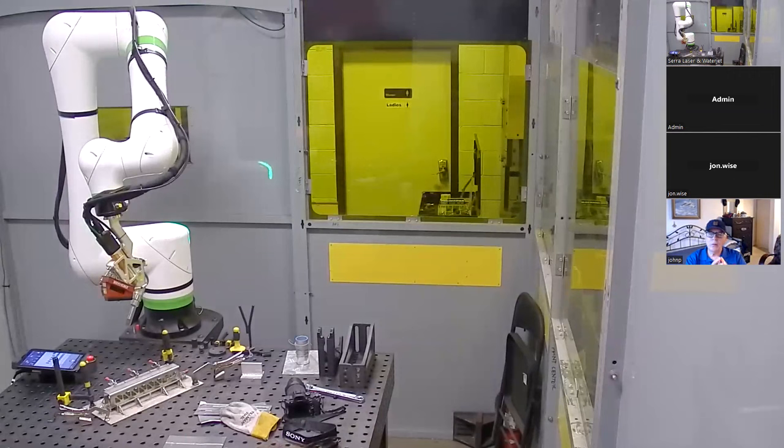You can see the little key holes on the vertical bars. Those are so you can slip a bolt head through the center part and drop it down, making quick release hanging mounts. There's also a wire towards the top — that's the safety interlock on the door. The laser uses a redundant safety interlock system. There's a magnetic reed switch with a redundant circuit: if the door were to open, the laser would be shut off. That is something you want to hook up in your system however you make your door.